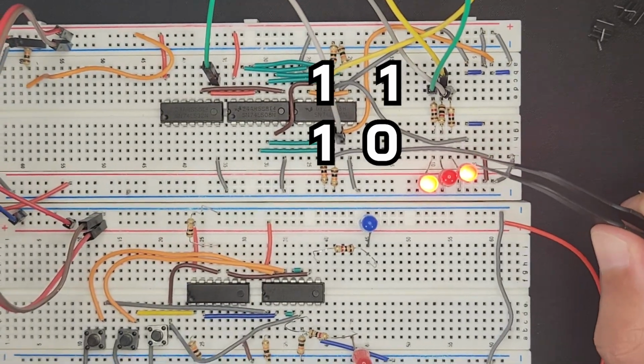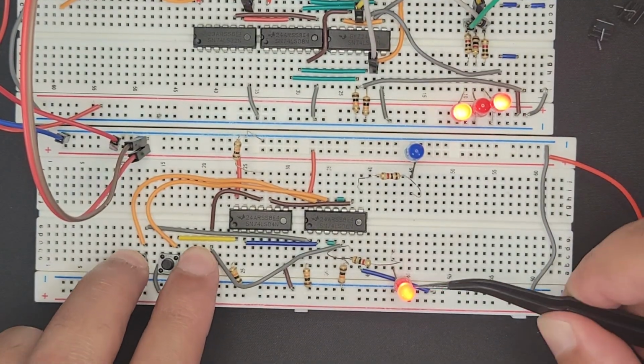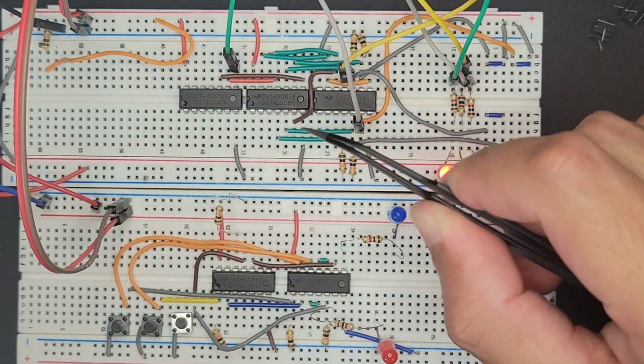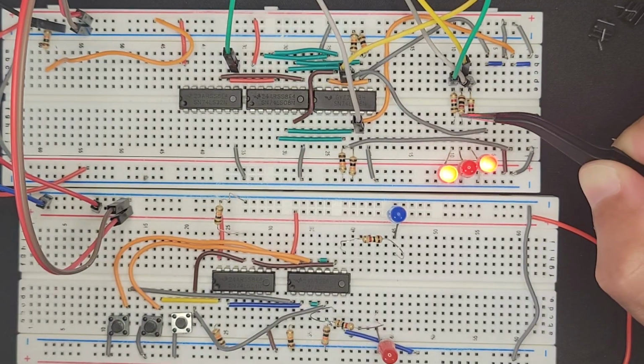So we see that our add is always on right now. And we really only want it to be on when we receive the instruction to add, which would be this one. What I'm thinking of doing is, right now, these wires are carrying basically the outputs and the sums from the logic gates. I think if we just use some simple transistors, we can have a pretty easy configuration.